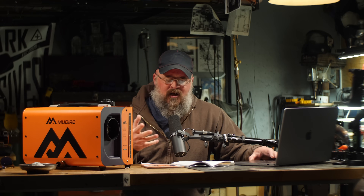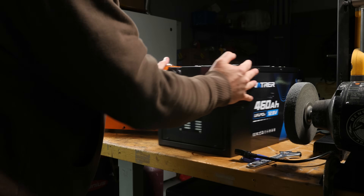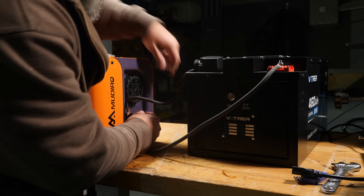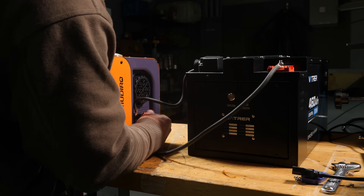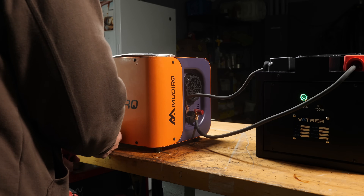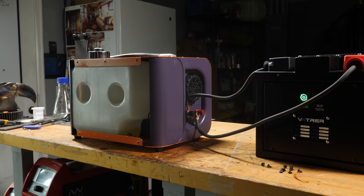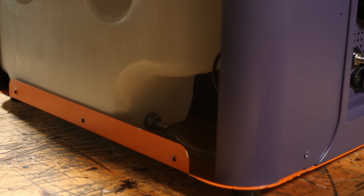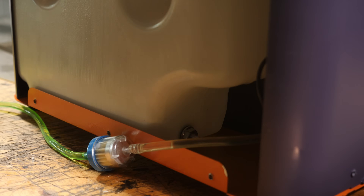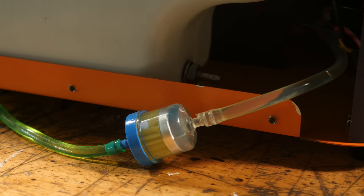Now let's do some benchtop tests. I wanted to run this heater off of a 12 volt supply with a BMS that can give me power draw, so I'll have two different ways to measure power consumption. This unit does have an internal fuse, so I did not run a fuse inline from the battery. I realized I needed an accurate way to measure fuel, so I pulled the side cover off, connected my own fuel line and a small fuel container to measure consumption over a 30-minute run. I used a fuel filter to add a length of fuel hose back to my fuel flask, and it took a little while to run the heater and get all the air bubbles out of the fuel filter.